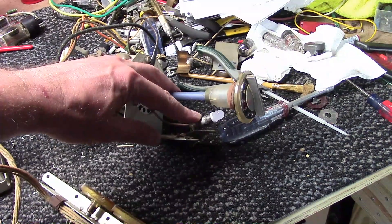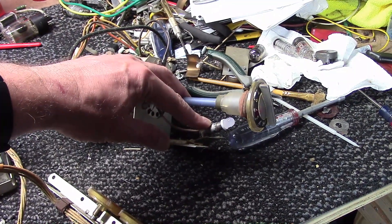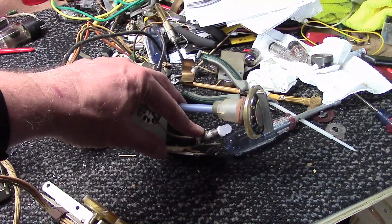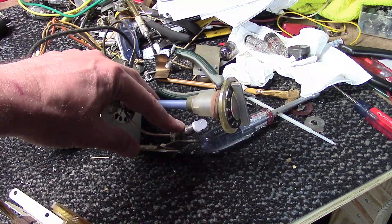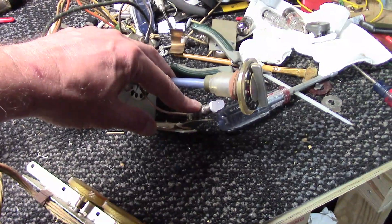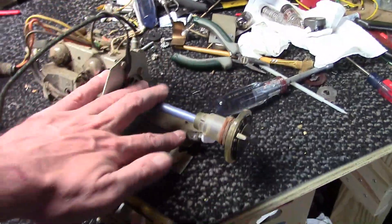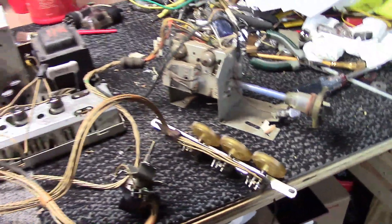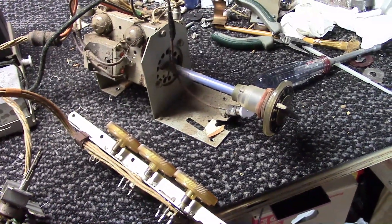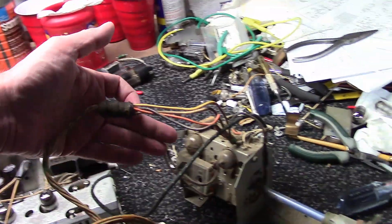There's a pilot light on them. They are often burned out because it's nearly impossible to get at them without pulling the whole set apart, so they often didn't get replaced. It's a type number 47 bulb — super common, 6.3 volt AC bulb. I've been replacing them with LED equivalents. The color spectrum is a little different and they're a little brighter, but they will last a lot longer. Given how difficult they are to get at, I suggest the longest lasting replacement you can get. If you want to stay with incandescent, get a type 1847 — they are longer-life versions of a number 47 bulb.